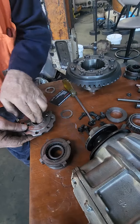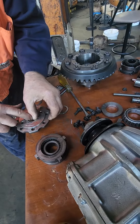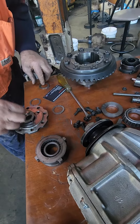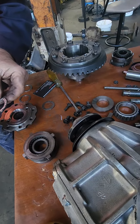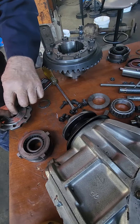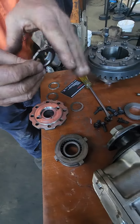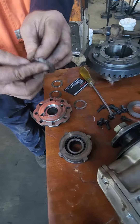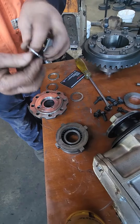Now this is — you can't rotate, you see. I just ground these little oil flats on there. On the grinder out there, diamond. So we had to grind all the way around there, back and forth on the grinder to make that key.